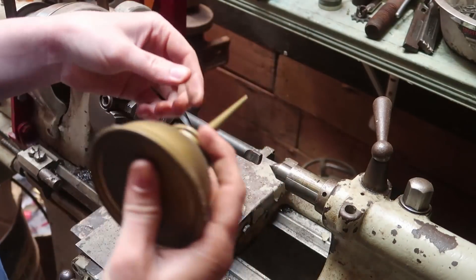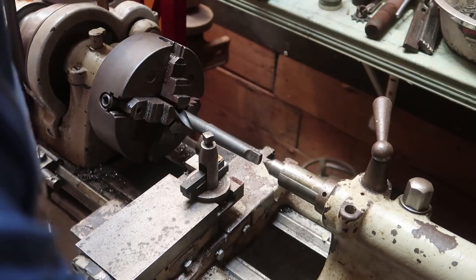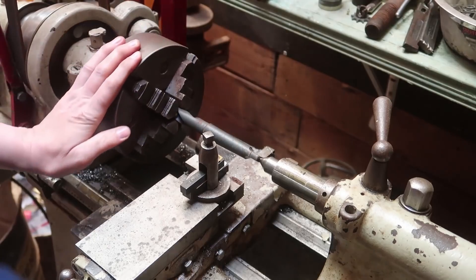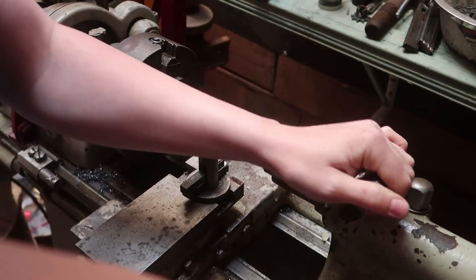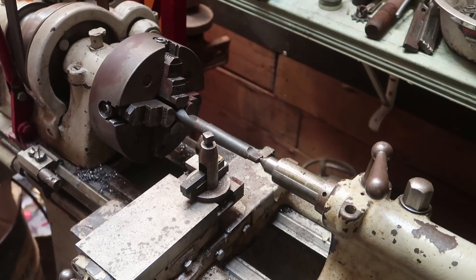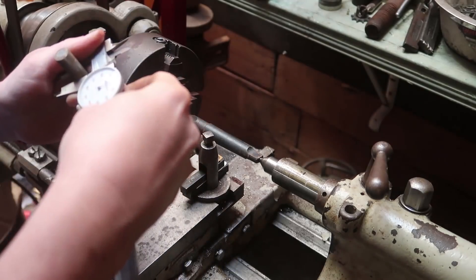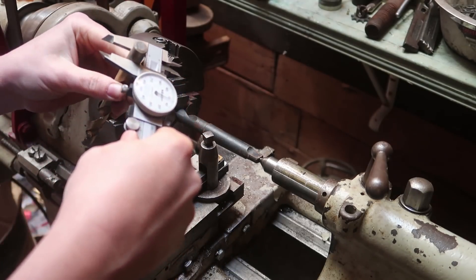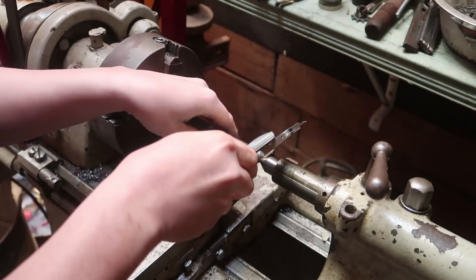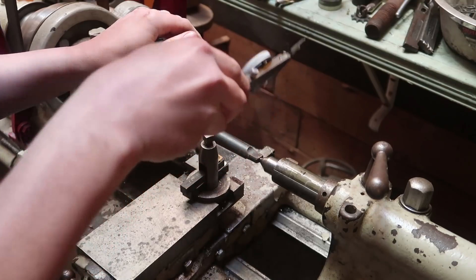Now a little bit of oil — it goes a long way. Oh, that's a lot. I'm going to use the tailstock to try to make this as straight as possible. I'm sitting at that because that's, I believe, half an inch — half an inch high speed steel. The space needs to be turned down as well.